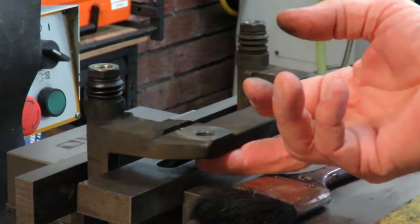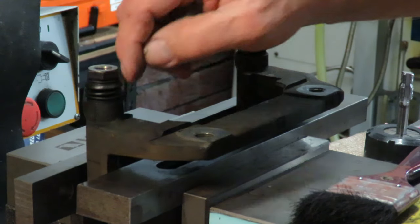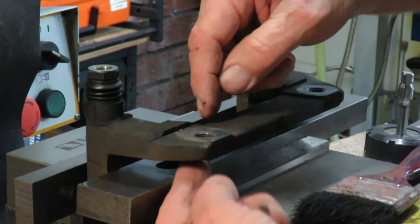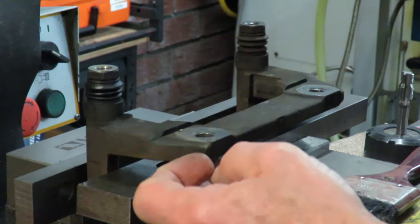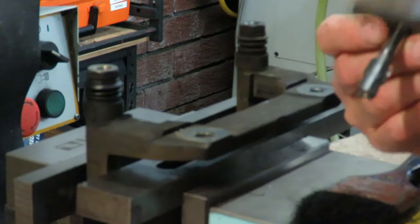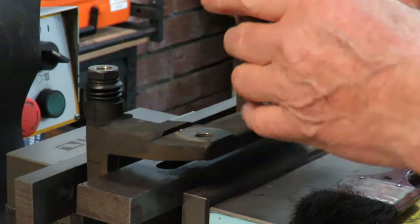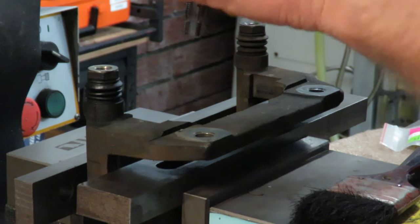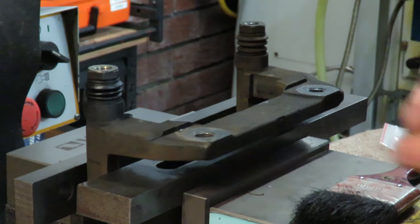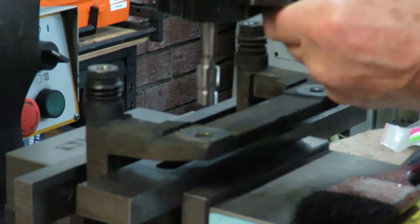One of the things here is that I've grasped it in a way that I'm not putting undue pressure on it, because it's quite thin around there. I've put a key into here and a key behind it. But what that's caused is I'm very, very close to the edge of the thread. So I'll be cutting the thread with this tap and then following through with a bottoming tap. That's an ER-40 collet — standard collet. Put it on slow speed.